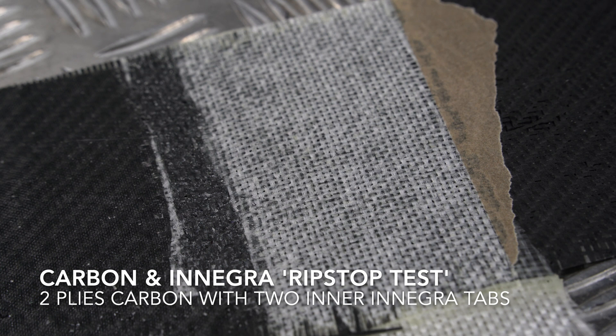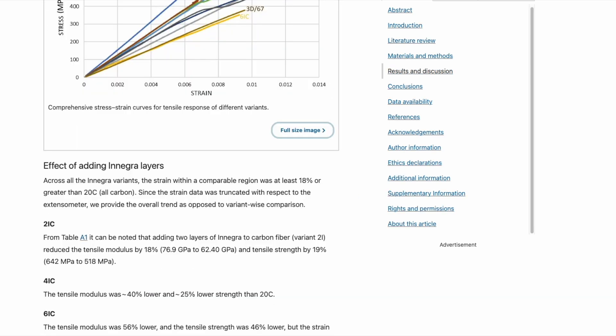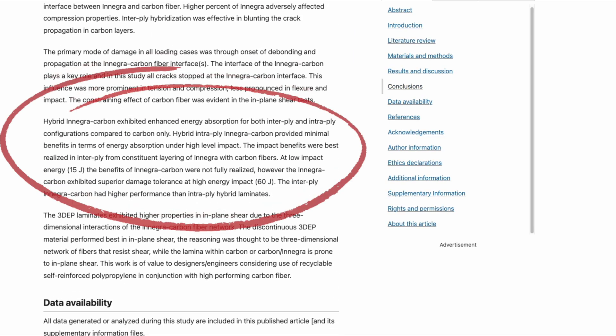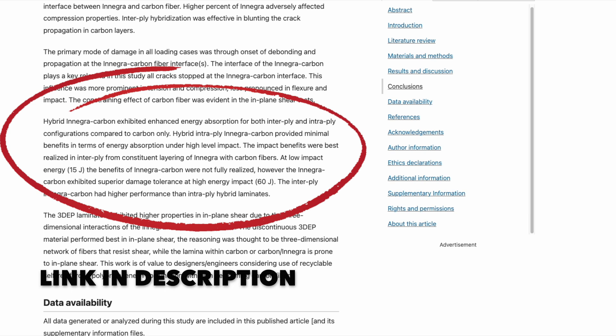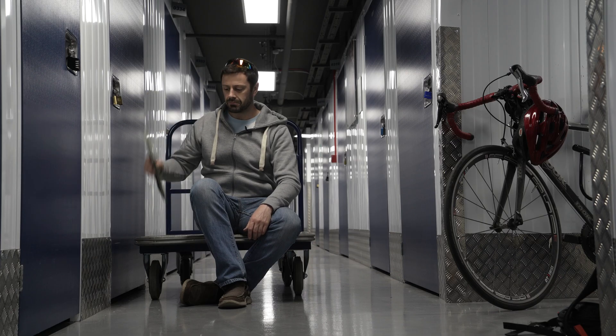Tell me your reaction - as expected, or shock, surprise and pure awe? My finding is supported by the observations of this study. It turns out plain ply sandwiches of various composites can really outcompete the snazzy looking hybrid ones. I also just found this study which suggests that if you add some silicon carbide powder to your epoxy resin, you might be able to improve the interlaminate adhesion - so maybe we can try that in the future. Don't tell me that wasn't exciting. Bye.